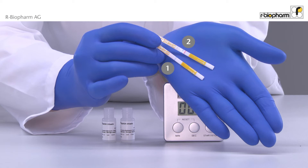The second swab sample was taken from the inside of production equipment. It shows a blue and a red band — the result is clearly positive. In this case, it is necessary to clean again with ethanol.